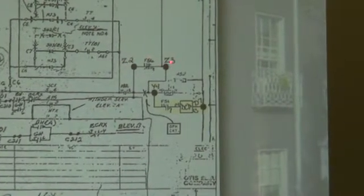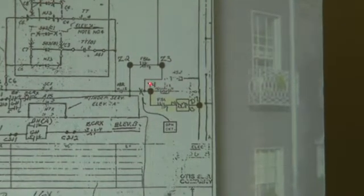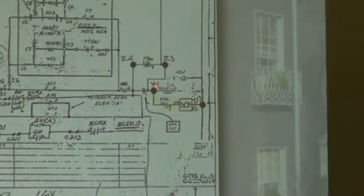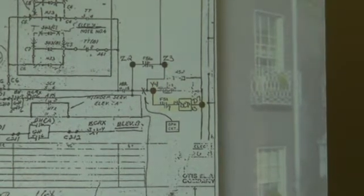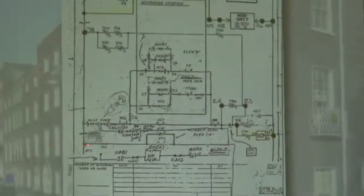Then you're going to put a new wire from Zebra 3 back to ASR 10 or Yankee 4. So Zebra 3 could be jumped to Yankee 4. You're going to see that in the prints later on. And then for this particular circuit, J4 is connected to RT1 terminal.